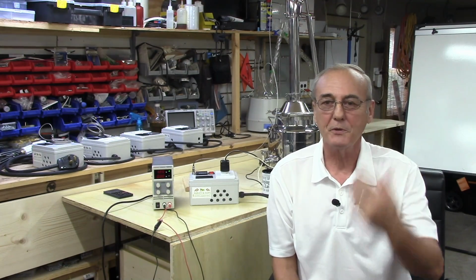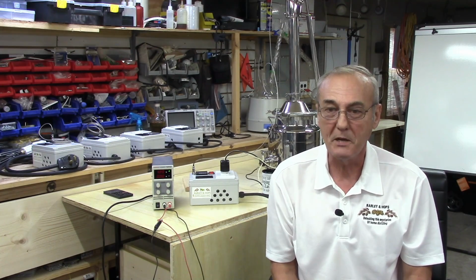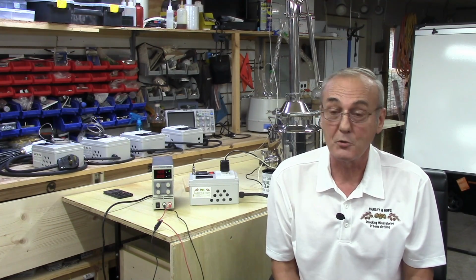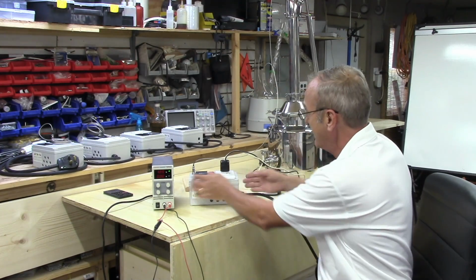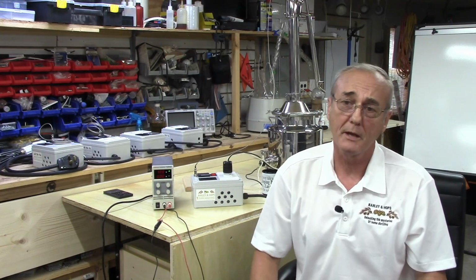Here shortly we're going to do another video on pulse width modulators, PWMs, which I also produce. The only difference really is a pulse width modulator doesn't have a feedback mechanism, so it puts all the onus on the individual to operate, as opposed to this, which has a feedback mechanism and operates on its own. You're going to have to provide your own thermometer if you're using a pulse width modulator.